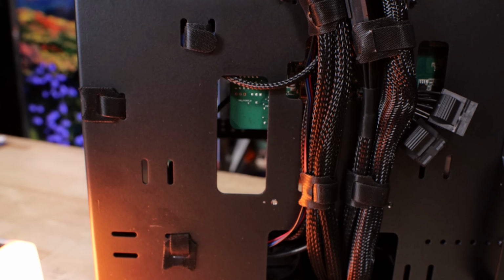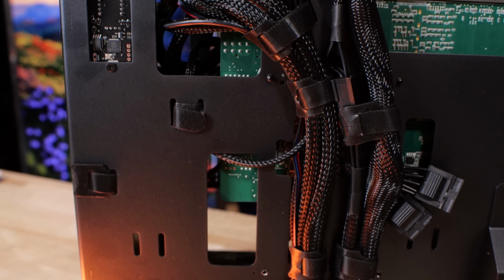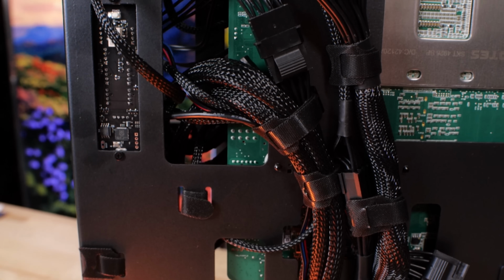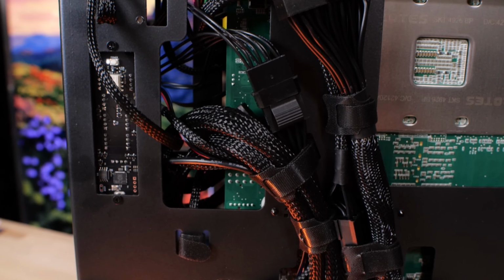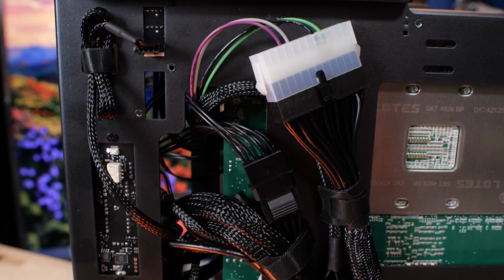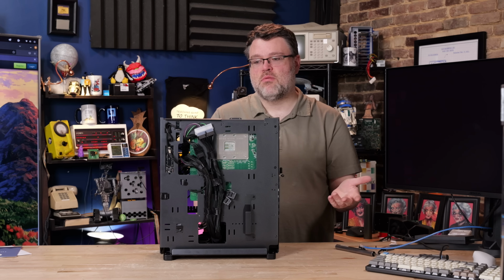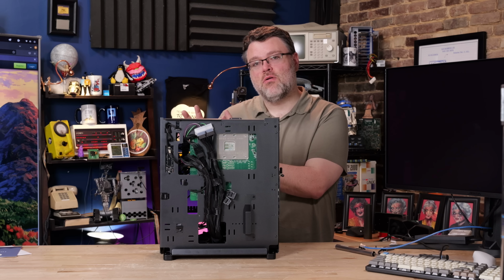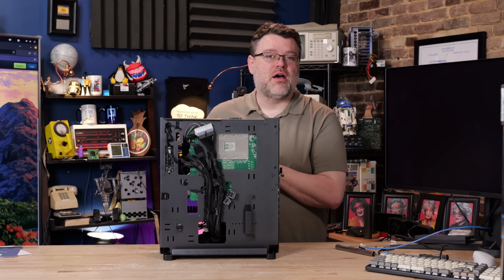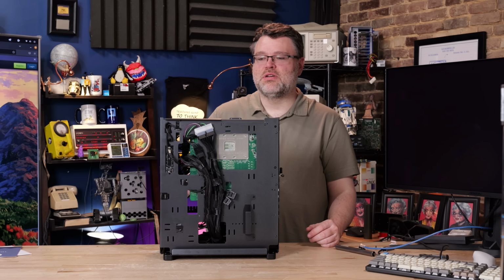This motherboard uses 12 volt natively. This is kind of important in data center stuff and data center scale. There are a lot of data centers out there that are running on DC only, like 440 volts DC, or have other things that they have done to be more power efficient. And historically, ARM has been a top shelf product for performance per watt, performance compute. Maybe not the absolute fastest per core, but in terms of unit compute per dollar, unit compute per watt, definitely leaders. And so that kind of makes sense that, let's try to do a motherboard design that's like this.